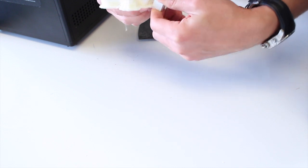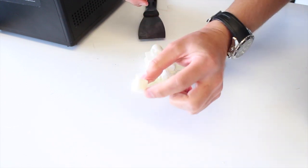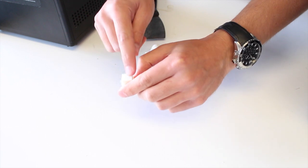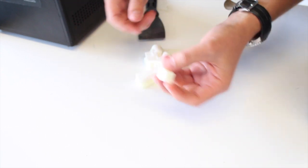If you want, you can remove the prime tower — it's basically just there to ensure that the nozzles remain clean when printing. It moves over and does a little square in each material as it switches between the two, and that's just waste.